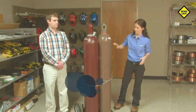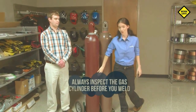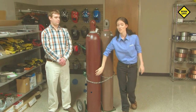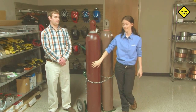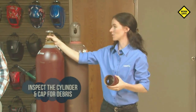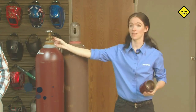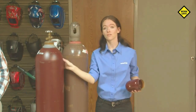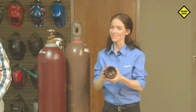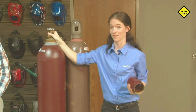Before welding, it's always very important to inspect the cylinders. Always look on the outside for any signs of arc burn or any soft spots that could be caused by rust damage, especially if you keep your cylinders outside. Whenever you have a cylinder that's been sitting for a while, it's always important to ensure that there's nothing built up on the inside of the cap or on the inside of the actual cylinder. So always look for things like spiders, wasps, and dirt. Birds love these things for nests, so always keep an eye out for any debris that could get in there.